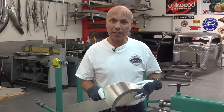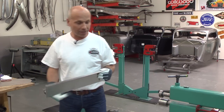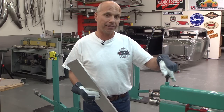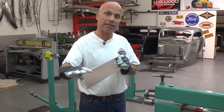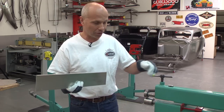So I figured out what I can do. I can take two flat dies in the bead roller, crank it down a little harder, and then I can run this piece — I bend it in the brake like this first, and then I can run it between there and I can stretch this edge and start curving this panel. And it's not going to crack. I make it longer and I make it thinner. So that's what I'm going to show you now.